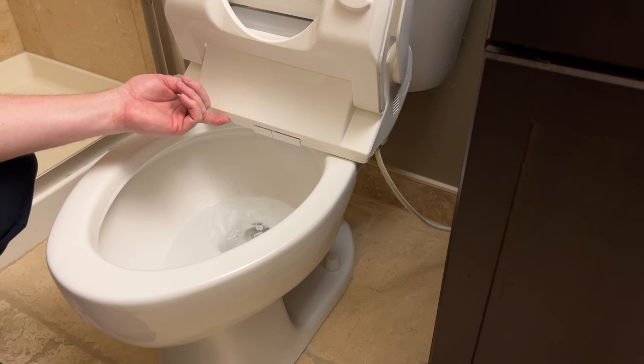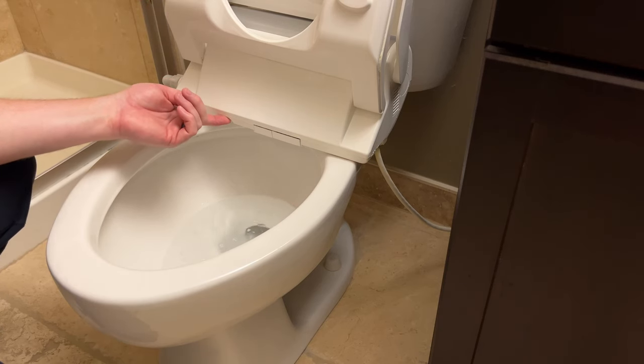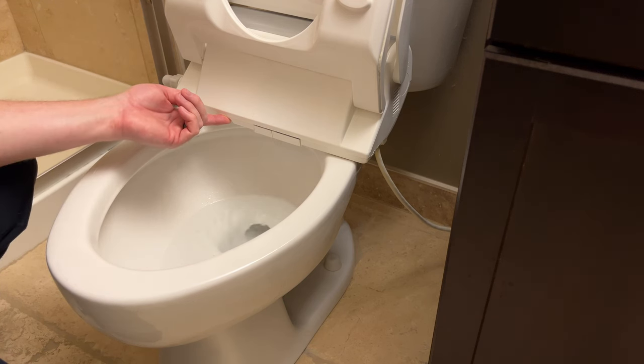Make sure that you've shut the water off and unplugged the unit. The last thing you want is for the coil to come on and start heating up with no water in there - you could burn out the coil. The instructions on the website don't tell you how to drain the toilet seat; this is found in your user's manual. I'll put a link in the description. In this case it's the BB2000, and the process is very similar on all Bio Bidet and Bemis-style bidet toilet seats.